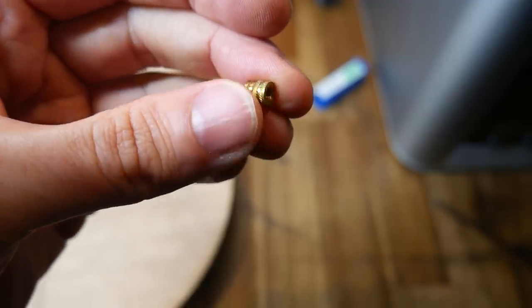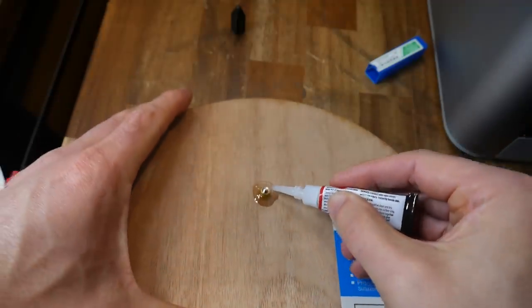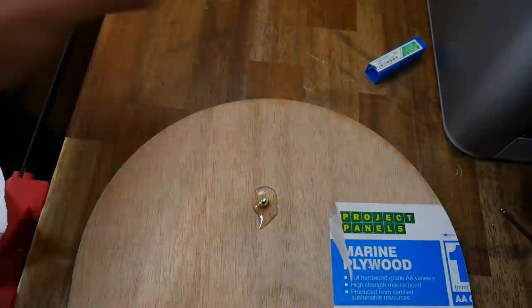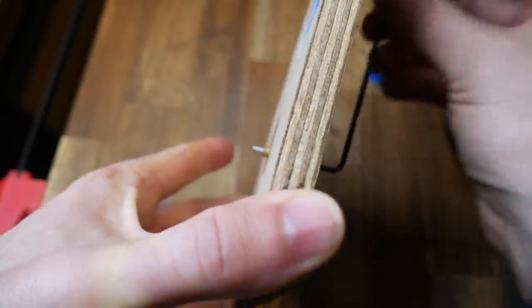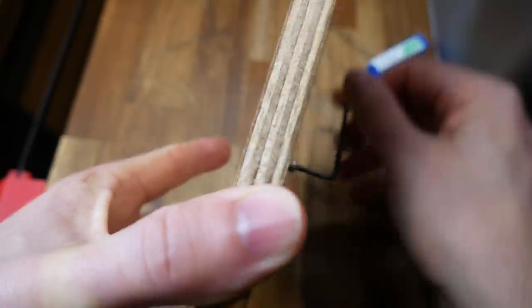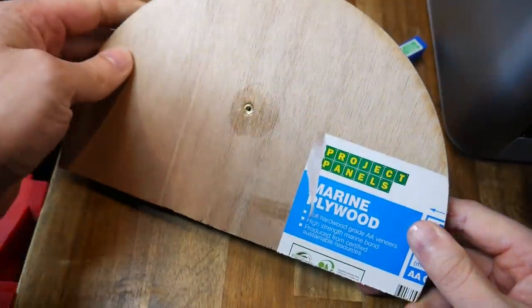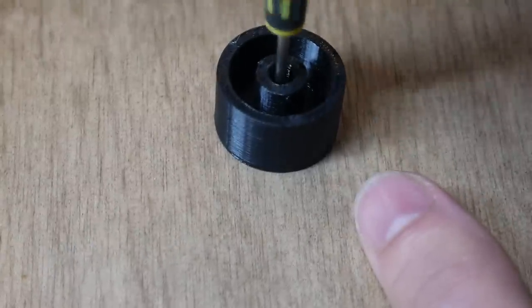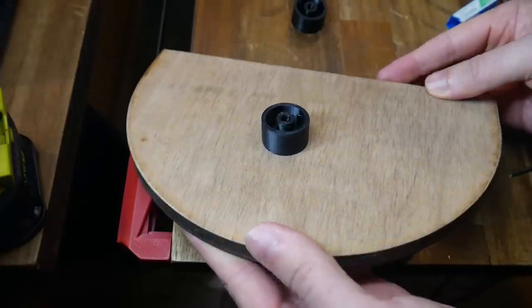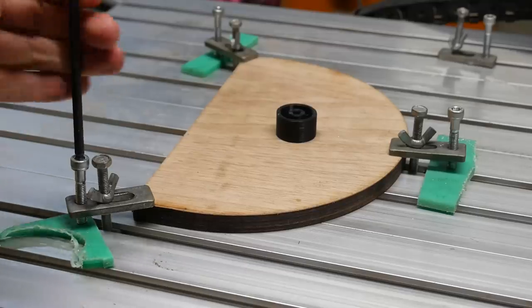I picked a piece of scrap plywood to act as a spoilboard, and drilled out a hole slightly smaller than the threaded insert before applying superglue. After removing the excess, I used a long bolt with a washer to pull the threaded insert into the bottom of the ply. The bolt marked the top of the spoilboard, but that didn't matter as the underside was flush and ready to go. I secured the first printed piece to the spoilboard, which was now ready to head to the CNC router, where it was clamped down in the centre of the work area.